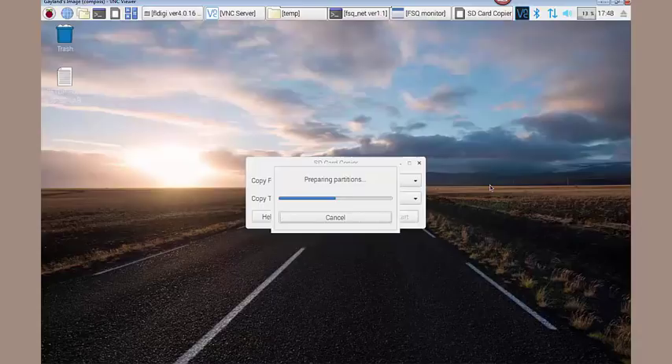I'll bring my Raspberry Pi over here and insert the card reader. Let me clean up the window and get FL Digi out of the way. We'll go into the Raspberry Pi menu, into accessories, and bring up the SD card copier. I recognize the name of the card in my Raspberry Pi, and the generic mass storage is the little chip I just put in. We're ready to start copying. It's a two-part process — the first part goes fairly quickly. The second stage will take quite a bit of time, probably at least 15 minutes. I'll stop the recording and come back when it's done.